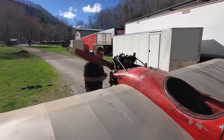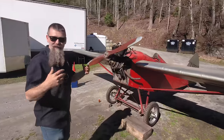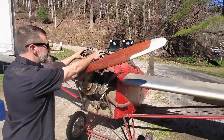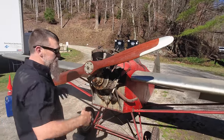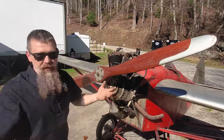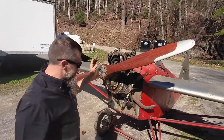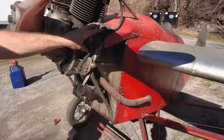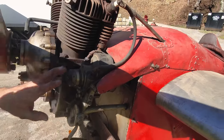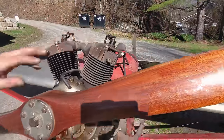Now what we're looking at, come on over here, Steve. This thing is incredible. And the old saying, if Harley built an airplane, would you fly in it? V-twin 1927 Harley-Davidson engine. That's what Wilson Miller used for the core of his build here. And 74 cubic inches. It was Harley's power plant really from 1921 all the way through 29. Virtually identical engine to this. So this is actually set up with a baby Bosch racing magneto, ultra rare racing mag. If this wasn't on such a cool plane, I'd love to put it on one of my racers. Updraft Schebler carburetor. Normally your carb hangs way, way up here. They've got this thing way down low.